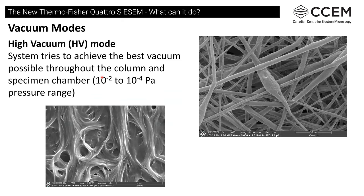The ESEM can be used in high vacuum mode — nothing prevents it, and it still has all the detectors needed to collect secondary and backscattered electrons. Being field emission, it's better than a tungsten machine. Because it's a fairly modern machine it has some very nice detectors, and we can look at polymers at 1 kV at 3.6 picoamps and still get a relatively good image.